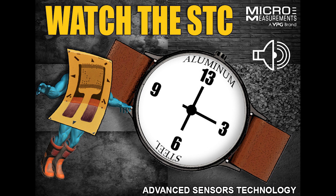So we're going to bond that gauge to that titanium silicate, throw it into some heat and look at its polynomial for high temperature, and throw it into some liquid nitrogen to look at how it behaves cold. That polynomial is what you get on the data sheet — it's either a fourth or fifth order polynomial. All you have to do is measure temperature. That's going to give you good temperature compensation, but if you want perfect, you need to use a compensating gauge.